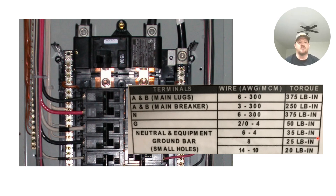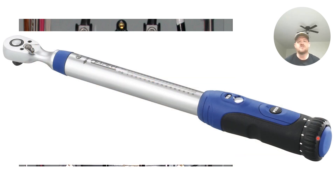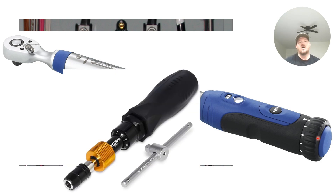Now let's talk about how to achieve the required torque. For all larger lugs, you'll use a torque wrench — either a 3/8-inch or 1/2-inch or larger drive — and snap on your sockets or Allen sockets to torque it down. You can also get torque screwdrivers, which are your best friend as an electrician nowadays. Set it to 12, 15, 20 — whatever value it is — and go through and torque them all down to make sure you've got a rock-solid connection. I'm the Electrical Code Coach, and my goal is that these videos will add value to you, and you will in turn add value to others.